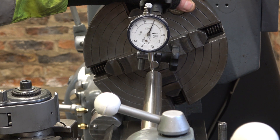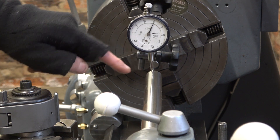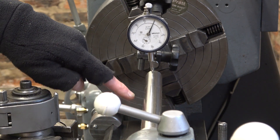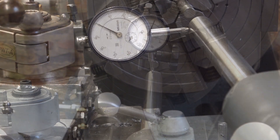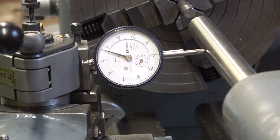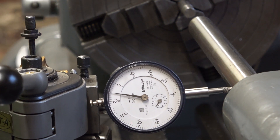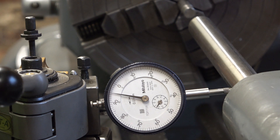It's not enough out to do anything about it, I don't think. But what I will do is set this up on the slide here and just clock it along and see what that tells us. Okay, that's reading zero now. And that's reading five. So five times 0.4 thou is two thou.